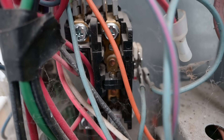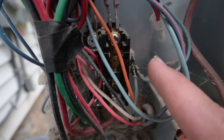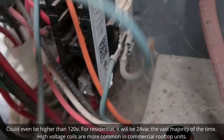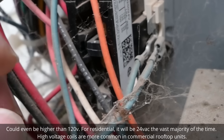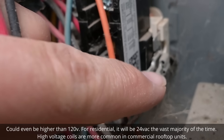It's not really hazardous voltage, so it doesn't actually bother me if that's still on. But if you want to be extra safe, you could turn off the breaker to your furnace or air handler in the house in order to de-energize the control voltage coming out here. In rare cases this could have a 120-volt coil in it — the coil is the electromagnetic coil that pulls that contactor closed. But in this case, and in probably 99% of cases, it's going to be 24 volts nominal, closer to 28 volts measured, coming in on both sides of the contactor. That's where our power goes for pulling in that contactor.